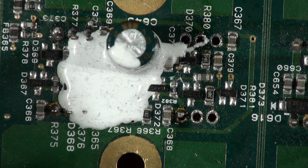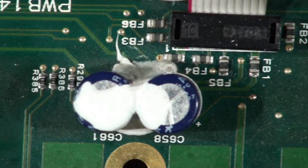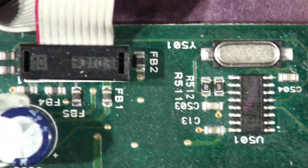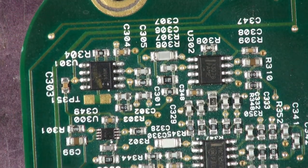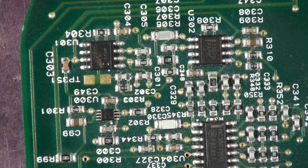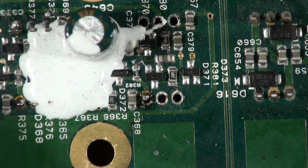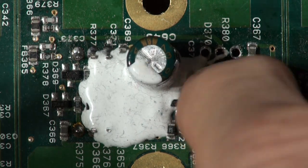So that's what you need to change. There is a clock over here — a 500 kHz crystal — and that's a logic divider chip. That chip can blow up, so make sure your 250 kHz clock is going down this end of the board via the ribbon cable. It's divided by this chip that can get blown up as well. Generally speaking, you should have a nice 250 kHz clock bouncing around. When you've changed those components, if necessary change these as well — it should work, and invariably they do. But if you've got two transistors blown on the output stage, do yourself a favor and change all of them.